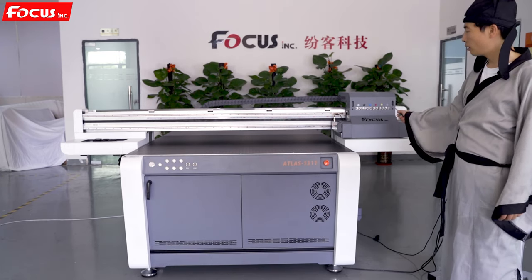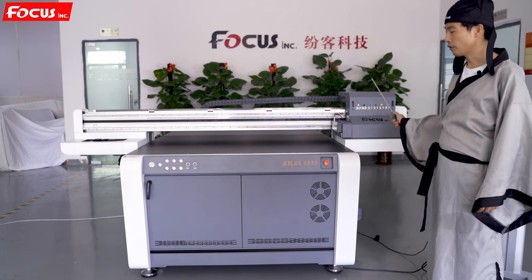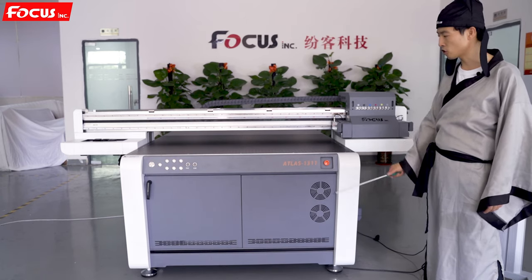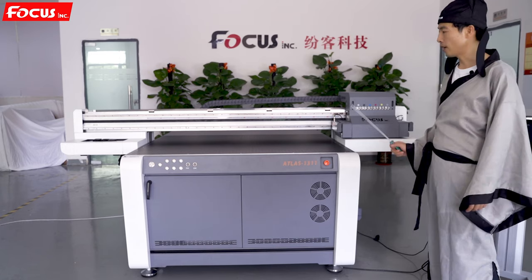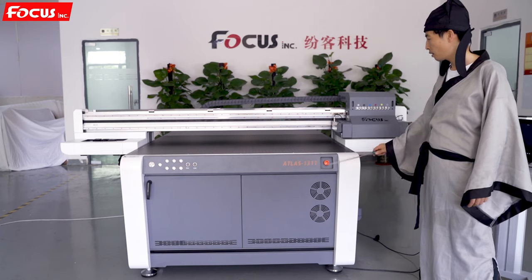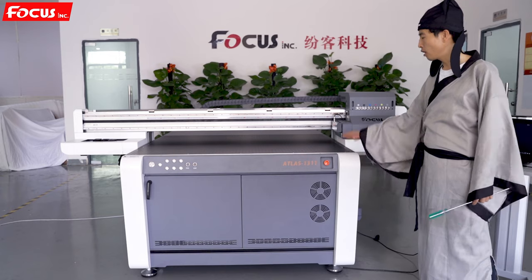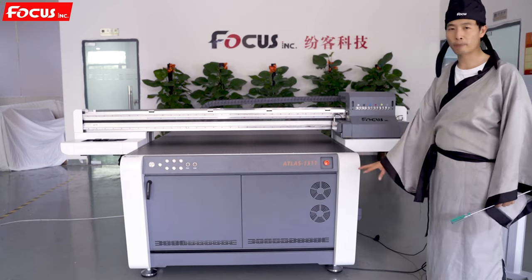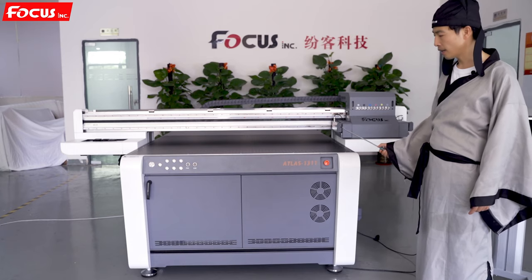The carriage is locked by the metal bracket on the left side and the right side. Right now, please do not power on the machine because the carriage is locked — if you power on the machine it will damage it. Once you unpack the machine, first double check all the spare parts on the front, middle, back, left, and right sides to be sure nothing is damaged and everything is brand new.